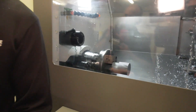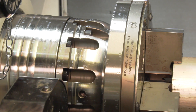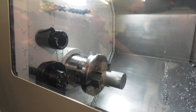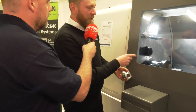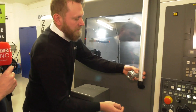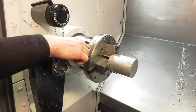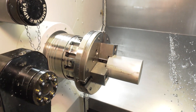Finally, this workholding — I know I'm going to go into a bit more detail in a minute, but in your opinion, why was this chosen? Well, the physical size of the workpiece is 70mm at its maximum, so I needed to cut from a 75mm billet, and the through bore on this machine is 65mm. As a way to change from a bar-fed machine to a billet machine quickly and easily, what we've got is a three-jaw module mounted to the face of a collet chuck. From here forward it's a three-jaw chuck, and that bolts on to the collet chuck with three bolts and a key.